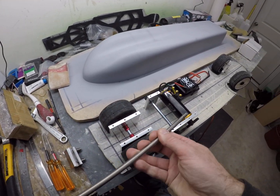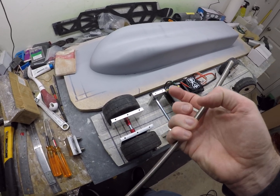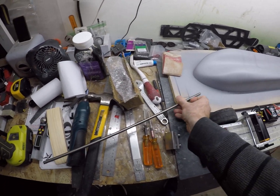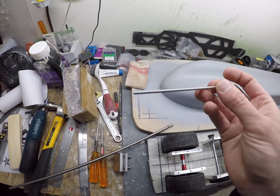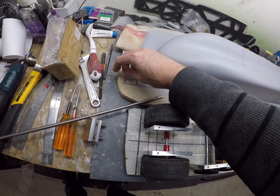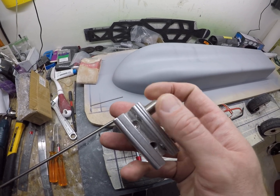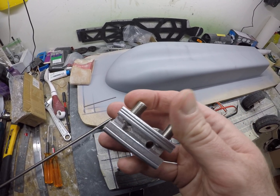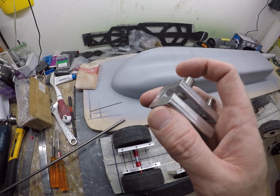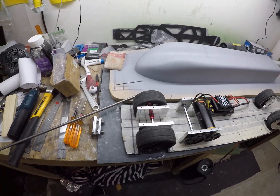I've gotten started on that. This rod, unlike the others I'd use — those are case hardened chromoly plated — is difficult to drill through. But this rod here is titanium. I've basically got a three millimeter hole through there. I've got some three millimeter pins — actually it's undersized, 2.8 or 2.9. I found this tool, and a guy on the Arma forum has a write-up about changing pins on dog bones. This tool can press it in with what looks like a security Torx bit.